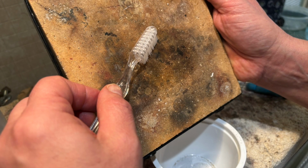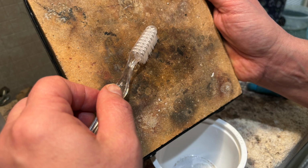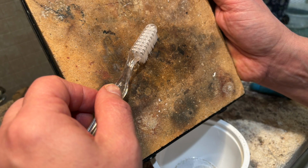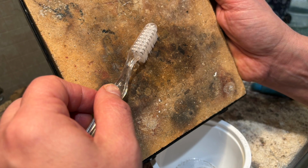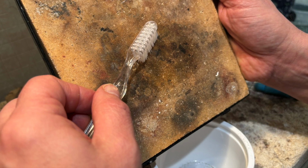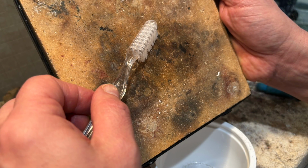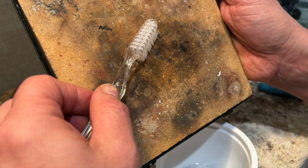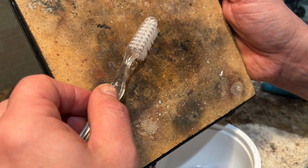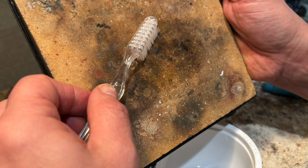And since the making of solder for filigree is such a labor-intensive process, I'd encourage you to have a clean brush, in this case just a clean unused toothbrush dedicated to this job, of carefully brushing off any of the sprinkled solder that wasn't used in the soldering operation, so that then you can use it in future operations.